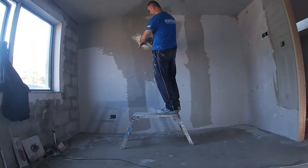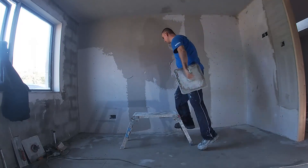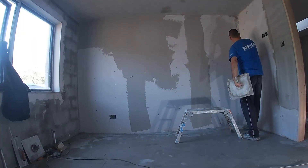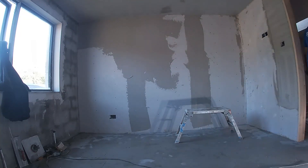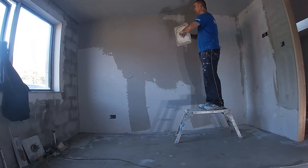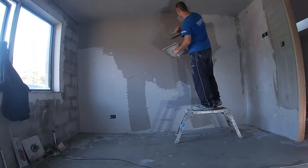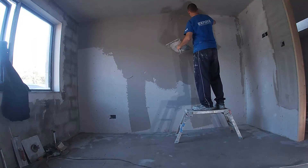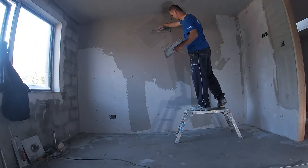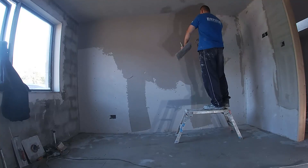I'm using a hop-up here — I find these benches quite safe. You can use stilts, milk crates, or step ladders; it doesn't really matter, just something handy to move around so you're not carting big heavy ladders about. I've set the board up in the next room so there's a bit of walking, but this is the perfect setup to show how to DIY plaster a wall. This is a pretty average-sized wall — you possibly would be better starting with a cupboard wall, but if you've built a stud wall and fancy having a go, this is definitely the video for you.